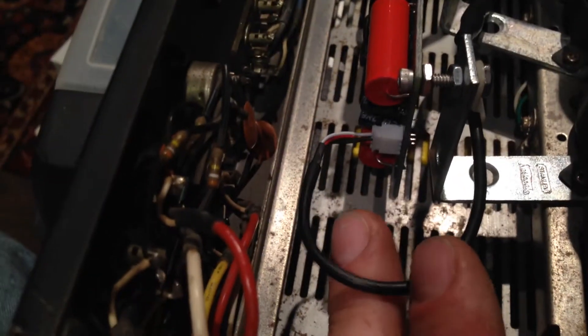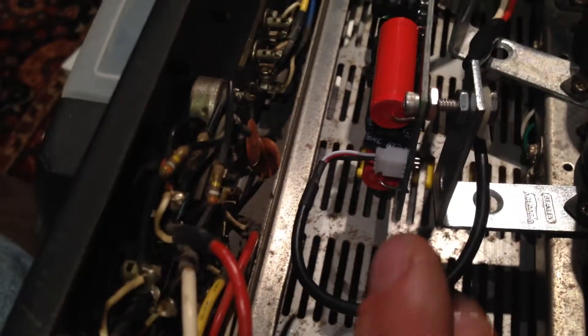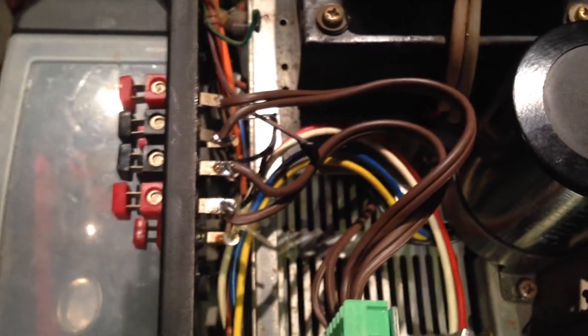All I had to do was hook the wiring up and solder the speaker outs using some heavy wire. For the input you just tie the grounds together and then the left and right. That plug just fit — I did this one night in like 20 minutes. I know it's cheesy but I'm going to make some proper brackets for it.